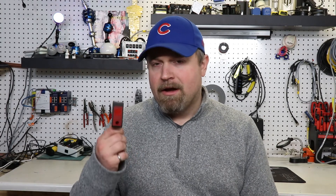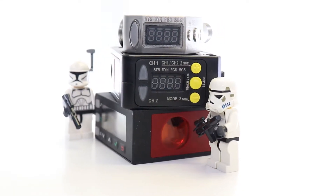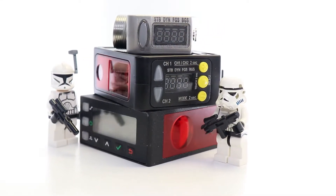Back in 2015, Banner Engineering released the Q4X — an IP69K metal housing laser triangulation sensor that had a 300mm range, which they later upgraded to 600mm. That same summer they also released the LE550, another laser triangulation sensor with 1000mm of range.